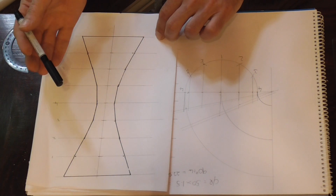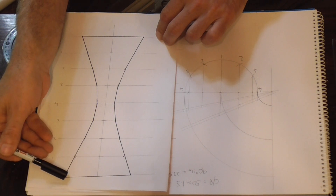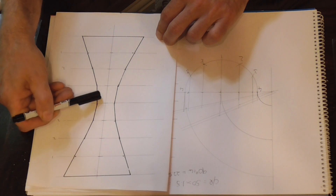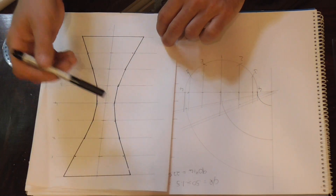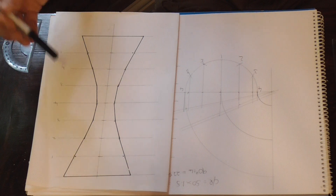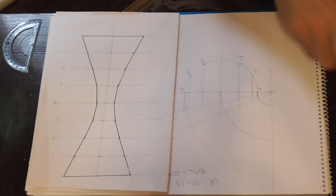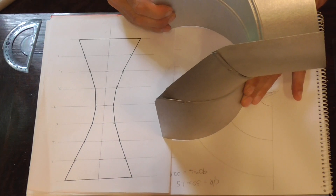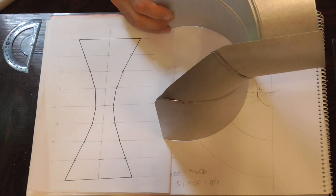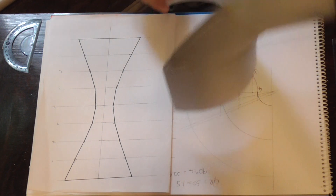All you need to do now is cut it out, place it on some sheet metal, cut that out, put it through the slip rollers, and then put your swage on. You'd swage along here with a female swage and along this side with a male swage — it's the same all the way through: starter, finisher, and the rest of the segments. When you've got them together you can put them together and you will end up with a perfect 90 degree throat. Thank you very much for watching — please subscribe to my channel, like the video, and share it. Thank you very much and goodbye until next time.